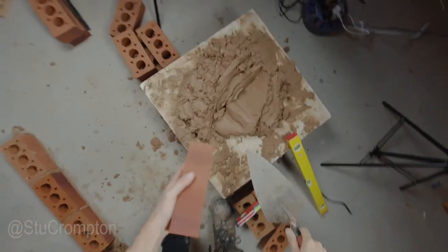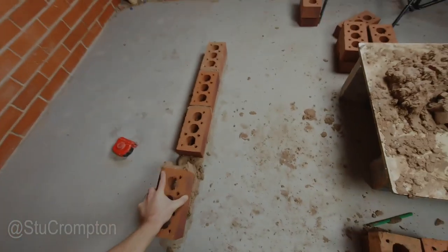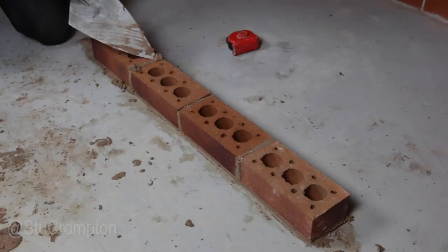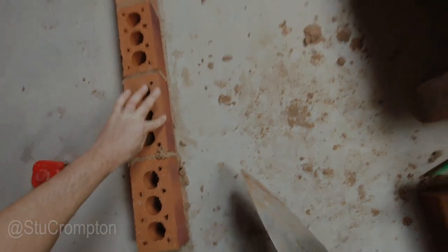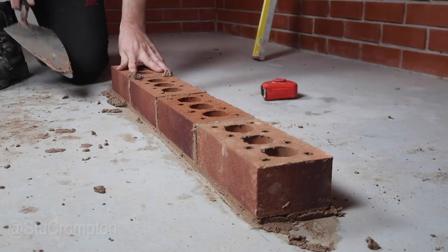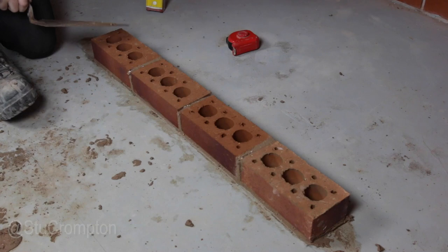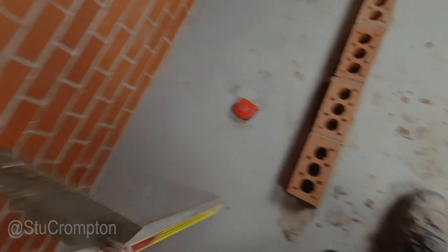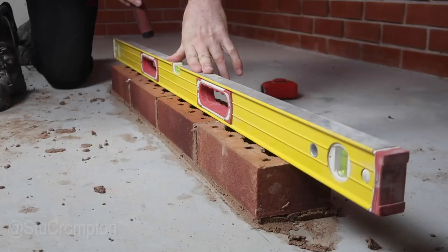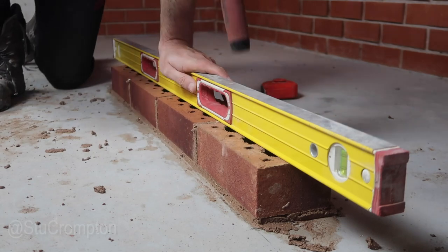We're going to need a longer level for the last one. Get our last brick — mortar down, up, right, left, then push it into place. Give it a wiggle, push it down evenly. Remember we want that aris to match up with that aris, and we're looking down this line as well. Every time before you put your level on, clean it — same with the bottom of your level; we want a good reading. Centre of the brick — when all these three are in good shape, pressure on the middle, couple of taps, couple of taps that way as well. That's it, perfect.